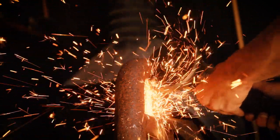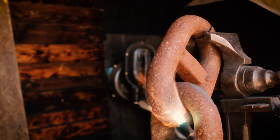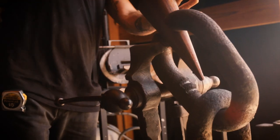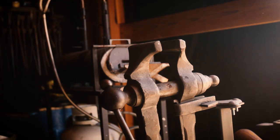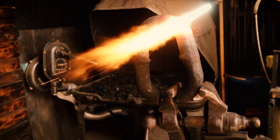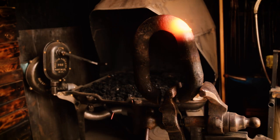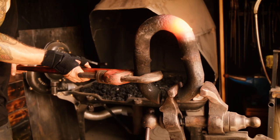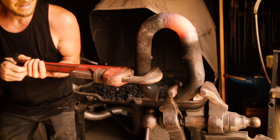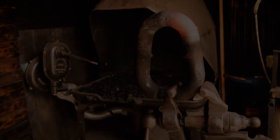There's a lot of back and forth about using known steels in forge work — tools and blades especially — because you don't want to have to guess or gamble during the process or when it comes to things like heat treating, or problems that may arise with the end product failing catastrophically for the user. Seeing as I have a passion for reusing or repurposing old material, I tend to save the unknown steels for more sculptural or wall hanger projects. I knew based on sparks coming off of it, I was probably dealing with something like a 1050 or 1060, which means getting these big boys heated up and straightened out was going to be an absolute task and a half.